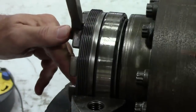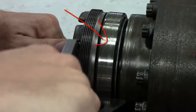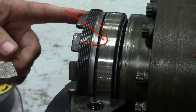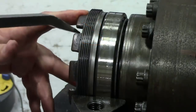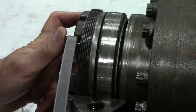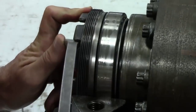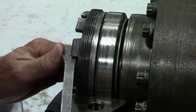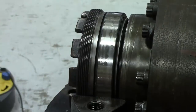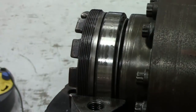While adjusting the flanged half adjuster, turn it in until there is no backlash, then back it out two notches. On the plain half adjuster, turn it in until the bearing cup just starts to rotate. When the bearing cup just starts to turn, count two notches to the left of the 12 o'clock position and turn the adjuster clockwise until that second notch is straight up at the top. Hit the bearing adjuster with a dead blow hammer to make sure it is seated fully — a snapping sound indicates it wasn't seated.